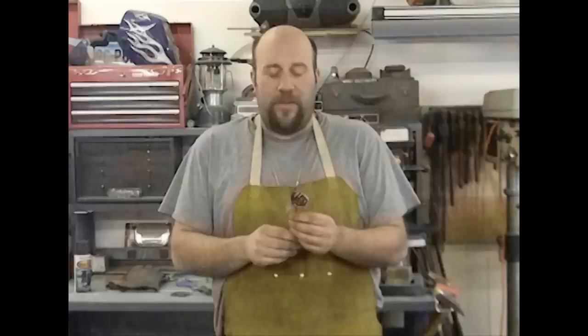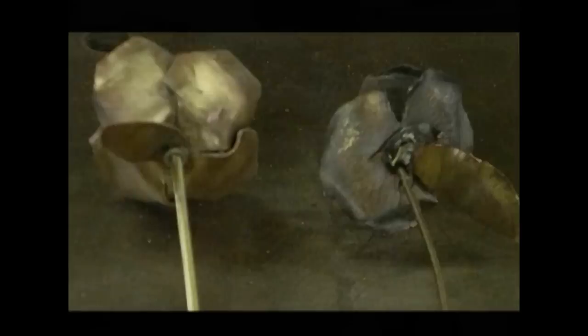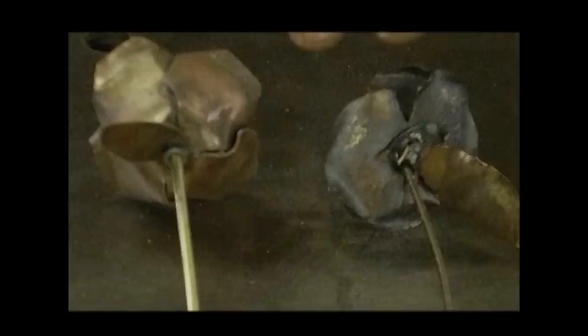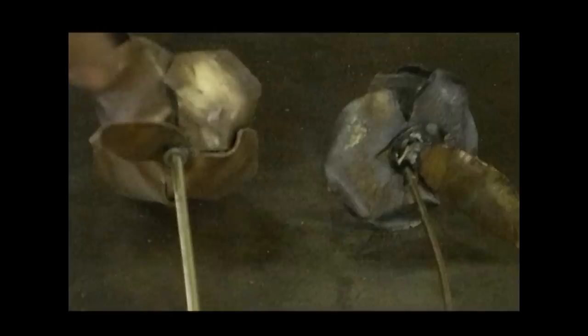A couple of things I was never really happy about in the production and quality of this rose was the underside of it. The flower itself looks really good, but I needed to figure out a way to neaten up the underside. In my first video, I tried to solder a copper leaf onto a piece of welding rod to give me a base for my flower petals, and it was an extremely cumbersome process. As I tried to manipulate the petals and pose them, the movement wore away at the rivet on the inside, and the flower petals themselves were a little loose — not a nice solid sculpture.